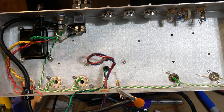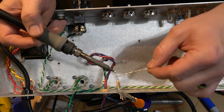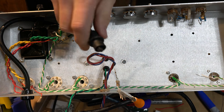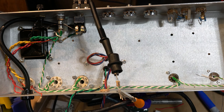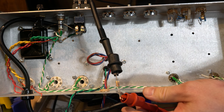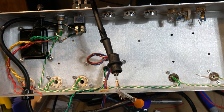All right, you can probably see that. I've just got that wound in so I can solder it together. One of my normal habits that I'm not doing here is to quickly make sure that I've got exactly the kind of resistance I'm expecting. So I'm going to turn this on ohms. And that's 97. 97. Okay, so they're within tolerance.